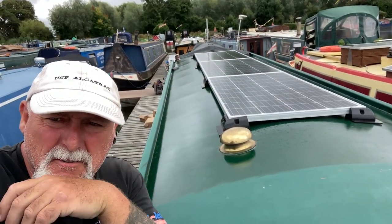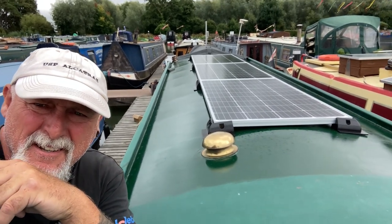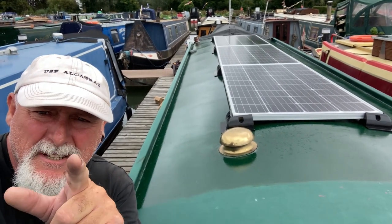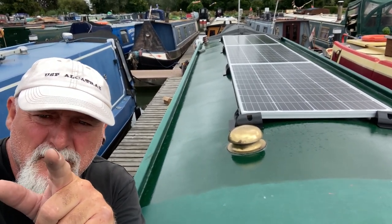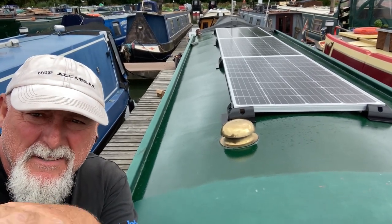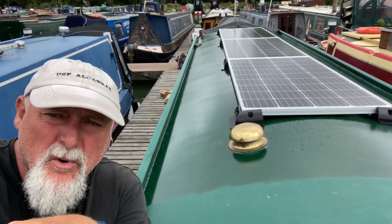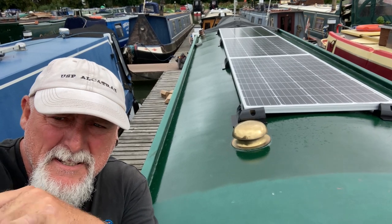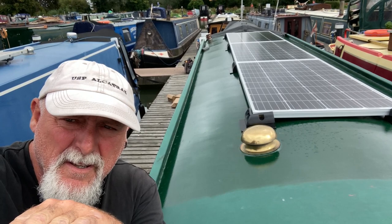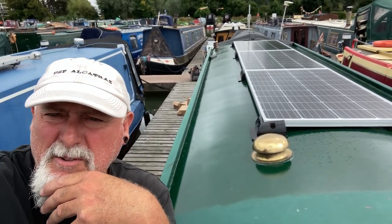Okay, I've just laid those on the roof, roughly in the middle. Put the brackets there. They're not fixed or anything, just to eye them up, really. So what I should do now is drill all the side brackets, pop screws through all the panels to hold those in place, and then I can move the panel around as one, line it up in the centre, and measure everything. What I do is put masking tape around the feet, and that allows me to jack the panels up, put adhesive underneath and drop them back down roughly where I want them, so I've got a guide.